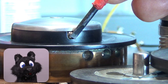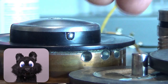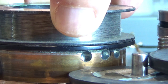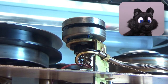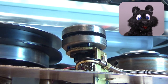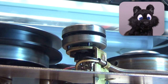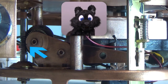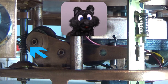The wheel that holds the wire spool has a ball and spring arrangement to provide some hold-down force. The wire head is mounted on a moving peg that slides up and down, making sure that the wire will be wound on the spools in an orderly fashion. The movement is driven by a worm drive on the take-up spool axle and a cam and lever assembly.